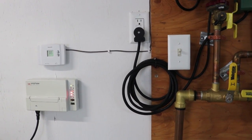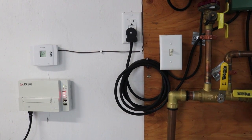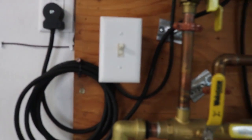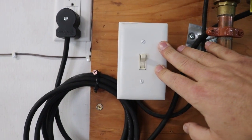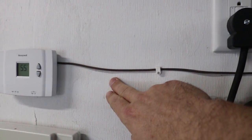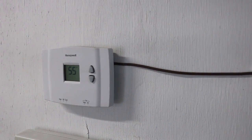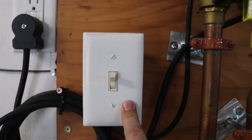When I originally installed the system, I realized it almost doesn't need a thermostat the way a typical furnace would, because the concrete absorbs so much heat and is very slow to heat up. So I originally installed literally just a light switch — since it can switch 120 volts AC and all the wiring for thermostats is typically 24 volts AC, I just used the light switch to turn the relay on and off. Later I added a thermostat and wired them in parallel, so I can turn the heat on with either the thermostat or the light switch.